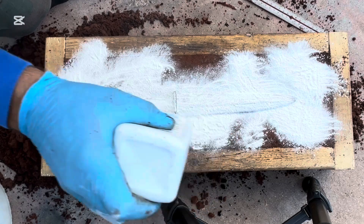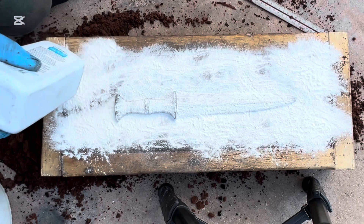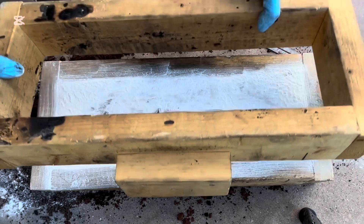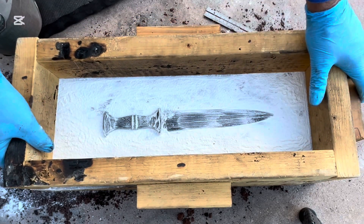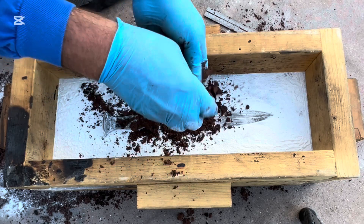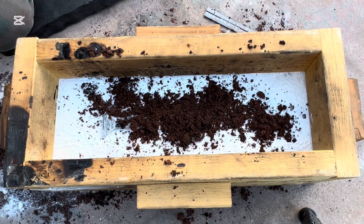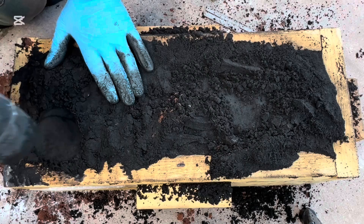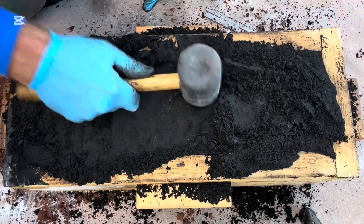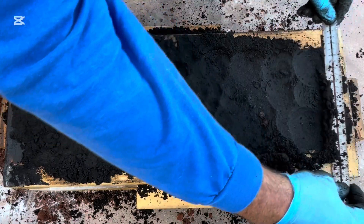This baby powder acts as a way to separate both halves of the mold after I buried the top half of the knife. This is an important step because if the sand sticks together or to the dagger, it really can wreck the whole thing. I placed the upper frame so that I could now bury the top half of the dagger in the sand. I scattered a small amount of facing sand over the dagger and then proceeded to bury it, packing the sand in really tight and vigorously pounding it into all corners of the upper frame before removing the excess.